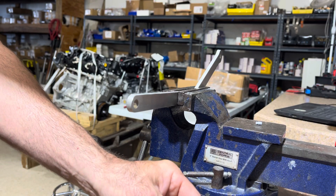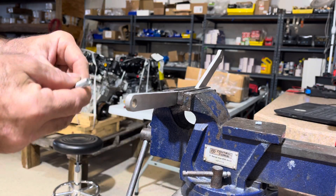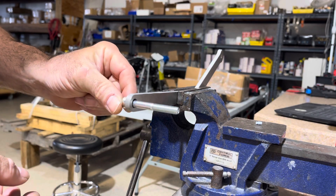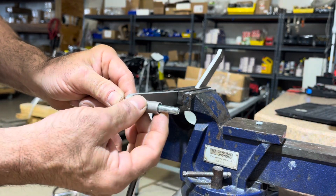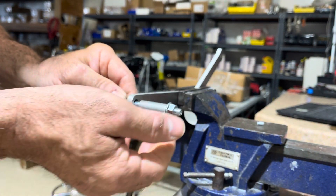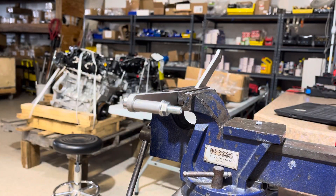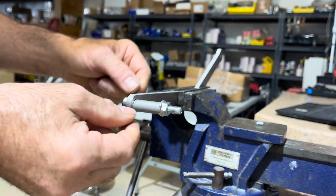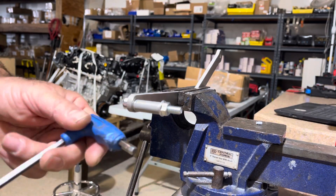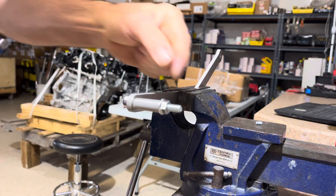In its simplest form, we've got a hole in the arm that comes down from the wing. These are big pieces — this is just to duplicate or show it with a bolt through it. And then there is a spacer and a nut. This is a simplified version where we've taken away any complexity. When that's tight, this creates a pivot point that's rigid, from which the flaperon can hinge from. So this is completely rigid.